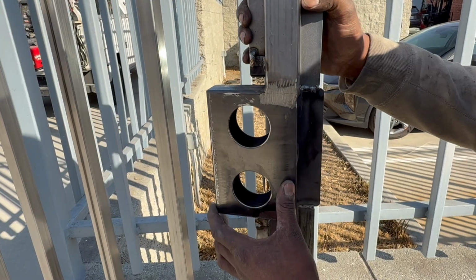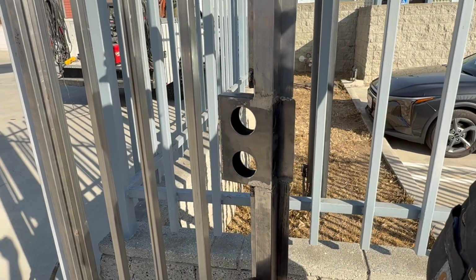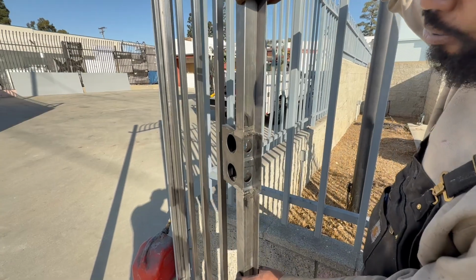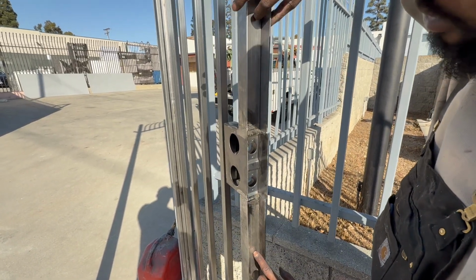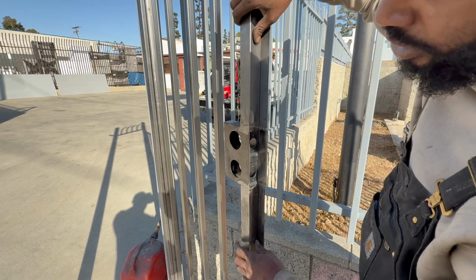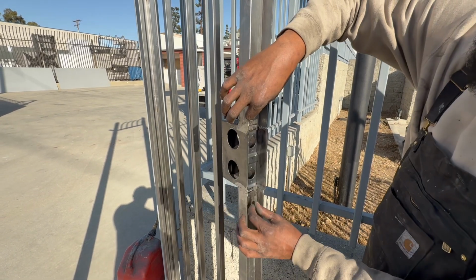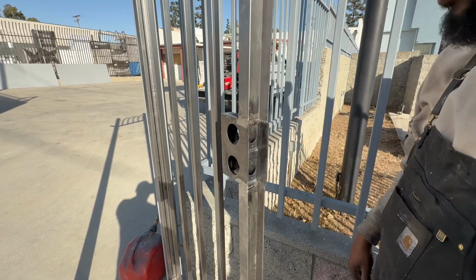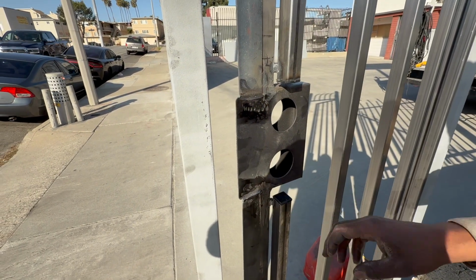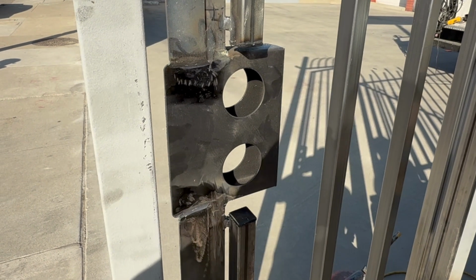So putting this lockbox in, you have to have a piece of metal from here to here to hold. And I usually use a bar metal because it's real solid bar. And I clamp it from here to here so you don't get movement left and right. And then I clamp it here and here, another bar, so you don't get movement in and out. I'll put a cut on one side, then clamp it, and then cut it the rest of the way. Then I put this in there right behind the bar so this piece can fit in. As you can see, it's flat right here to here, so that bar was right there to there. So you just make sure everything is straight, plumb. All right, looks good, looks good.